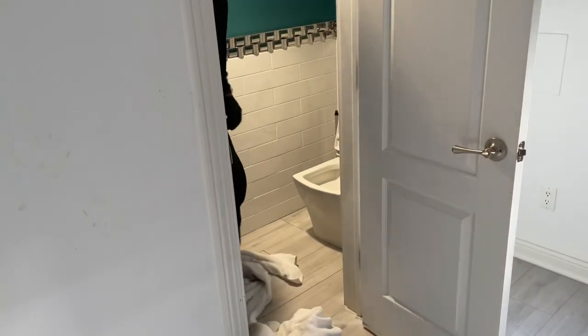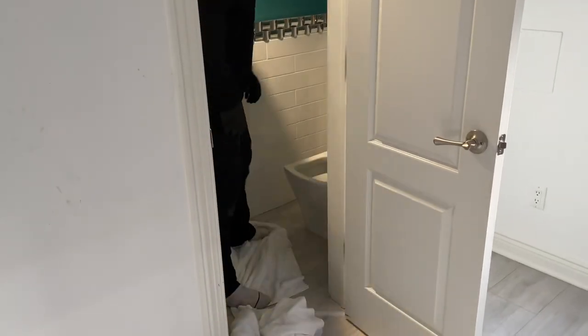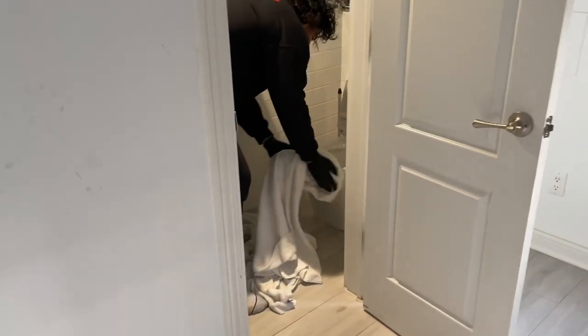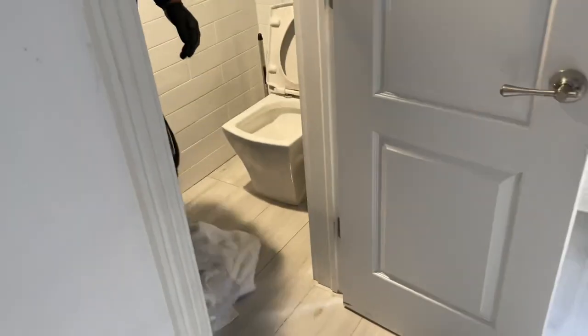The lesson learned here that you didn't know before is that the water that we take out of the boiler, if it's very hot, you don't want to put it down the toilet. I know it looks convenient, but when you crack that first bowl, then you'll know.